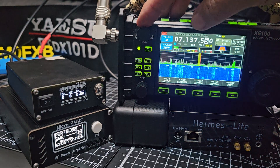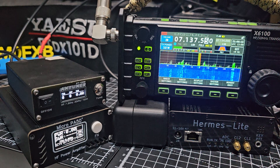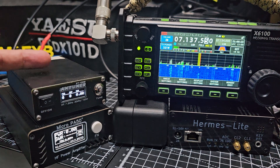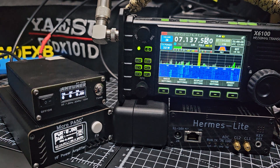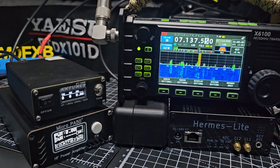Welcome back to the channel. I just want to show you the Micro PA50 — I just installed version 1.91 firmware, it's 2025 May the 4th. I'm using a separate tuner, but as you know you've got a tuner built into the X6100 anyway. This is going to give you up to 50 watts; we're running three watts here. I wouldn't go higher than about four if it was me.